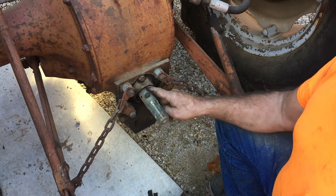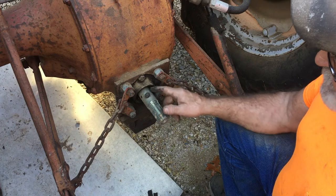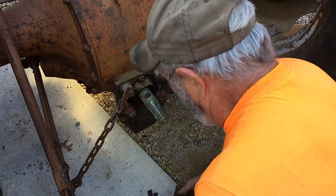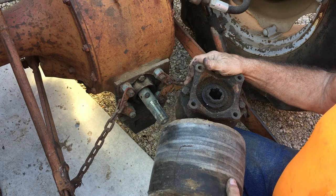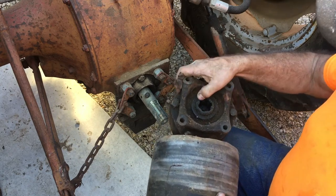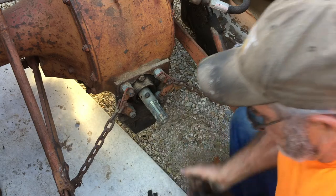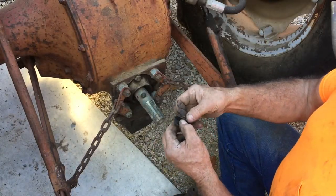This one here is an extension adapter, where you'll actually gain just about this much length whenever you slide that adapter on. Then there's another one called a flush adapter, which is what I always used on this right angle drive. This by chance happens to be a Massey Harris Ferguson right angle drive. And it is also a 1 3/8 six spline, but I only had 1 1/8 coming out of there. So the answer at that point was to use the old flush adapter.